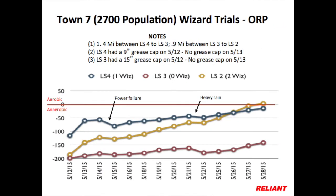By continuously checking ORP, oxidation reduction potential, of the wet well water at the low water level, just after the pump-off sequence, the natural change of the microbial population is simple to track, and the transition of the anaerobes to an aerobic microbial population always tracked the increase in dissolved oxygen.